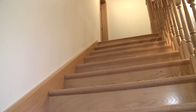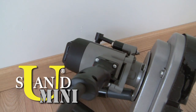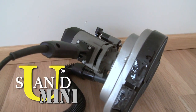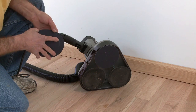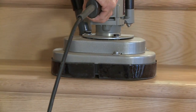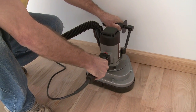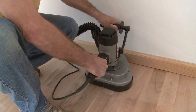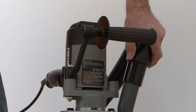Need to refinish your hardwood stair treads? The U-Sand Mini is a handheld version of the U-Sand, utilizing a 4500 RPM motor, three random orbit pads, and 5-inch hook-and-loop sanding discs. This unit is ideal for stair tread sanding, tabletops, edging, or wide doorway sanding. Weighing 19.5 pounds, this unit has a vac port that attaches to your shop vac.